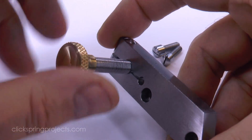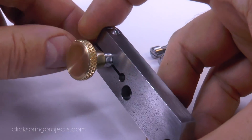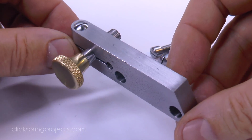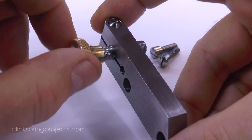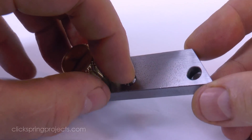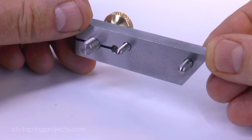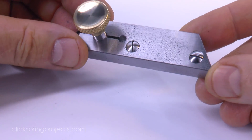And that's all of the bits and pieces complete. In its present state, with the closing screw left quite slack, the depth adjustment screw is a free and smooth fit. It won't take much closing force at all to give that a tighter feel and remove all play. So let's fit it to the machine and give it a good test run.